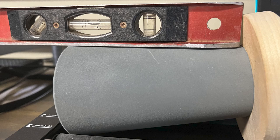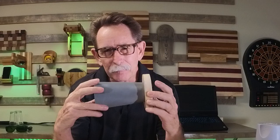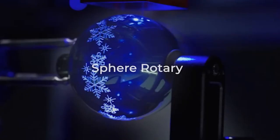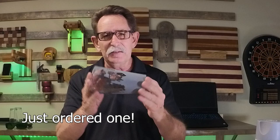One thing I figured out: because the glass has to go into the roller that comes with the machine, I wanted to keep it level. I went over to my CNC machine, did the math, and cut a board that would go through level. However, it will buckle a little as you're turning because this glass is even a bit bigger than what the roller is designed for. There is another roller system X-tool just released — I'll put a picture and a link in the description. That may be the better way to go, because if your laser is tilted you're not going to get the result you'd like.